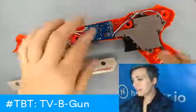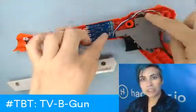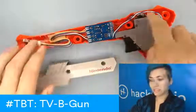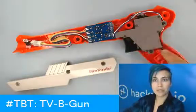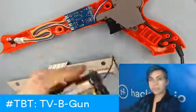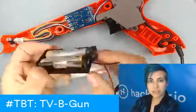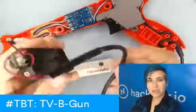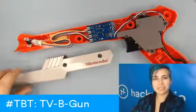What we have is the switch — there's a button on the board which I have replaced with connections to the limit switch, the trigger controller on the gun itself, so that when the trigger is pulled it connects and acts like pushing the switch. Besides that, there are these two blue and white cables that connect to the NES Zapper's original cable, and what I've done is put the battery pack at the other end of that cable. I've also added a little on/off switch, which isn't in the original kit, so I'll be able to stick this end into a holster and look like a sweet video game character because it'll still have the cable on it.